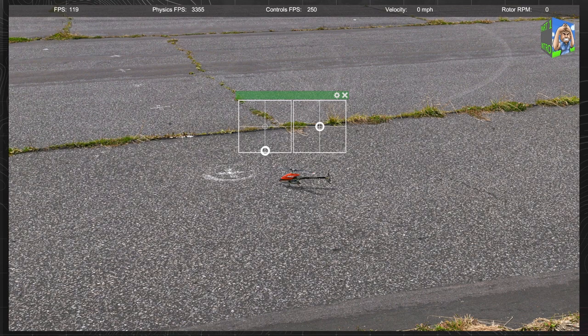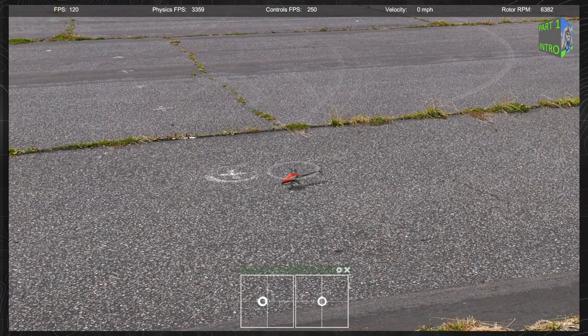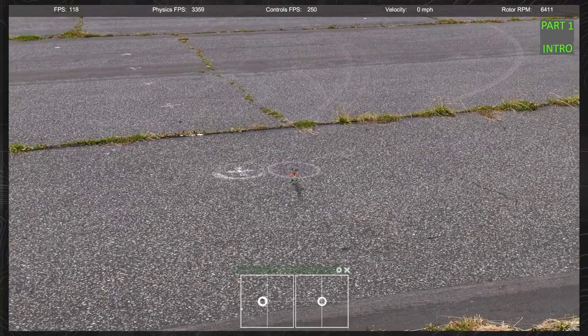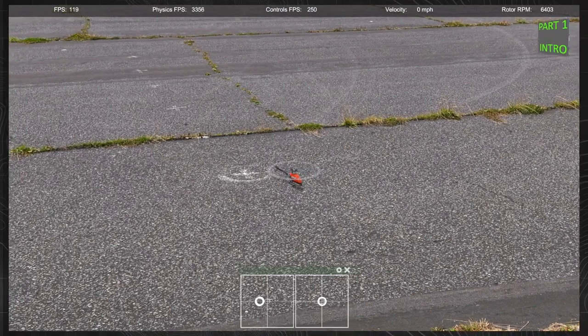Let's see how this translates to actually starting the helicopter up. Remembering that we're on the lowest setting — RPM 1 — and on the lowest collective, as we give a slight amount of power and increase the collective, the rotors spin even faster. At 50% in the top right-hand corner, the helicopter is quite light on its skids and going around at 6,000 RPM. The smaller the helicopter, the faster the blades turn; the bigger, the slower. Moving the left stick to the left, the helicopter's nose moves to the left — only a tiny amount — and the further we move it, the quicker it will turn.